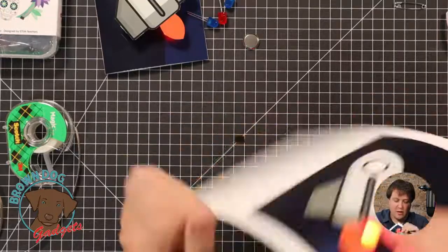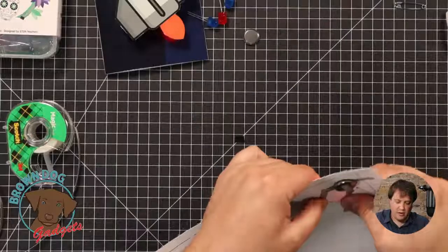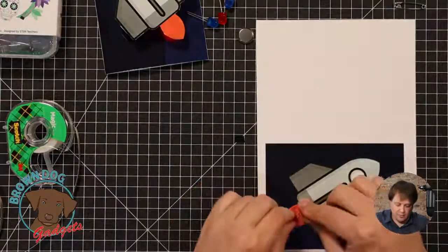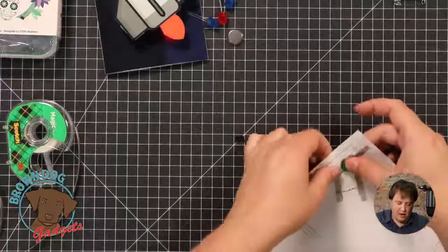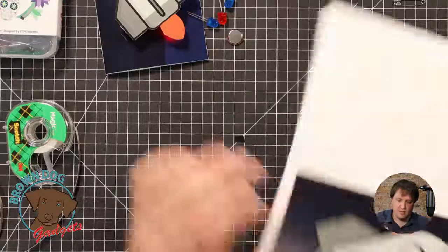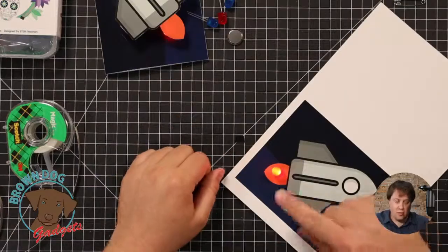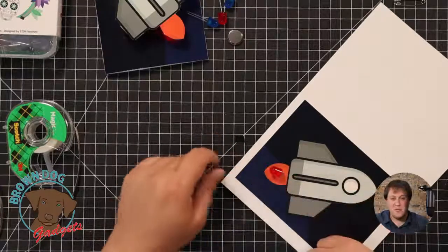So there we go. I've now added a forward-facing LED, if I press down on these here. There we go. Always press down on your connection, kids. I would pre-bend the legs to put it in, I think. A little tighter, but yeah. There we go. Nice. It's bending outward a bit, facing more down. I've got to press those down a bit better on the backside.